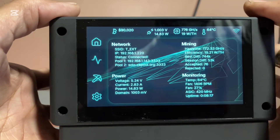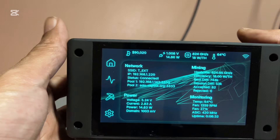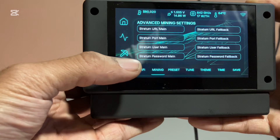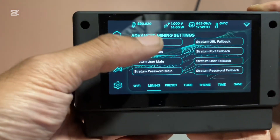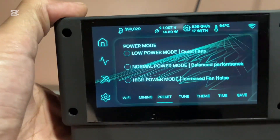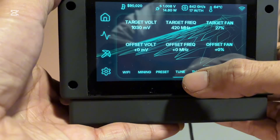Click a button and it'll show your hash rate. The next one tells you your network information and your IP address. After you type in your Wi-Fi and get it connected, I found it a lot easier to just type the IP into my computer and use AxeOS to set this up, because typing your bitcoin address and Wi-Fi on the touchscreen is very difficult. I tried to type in my pool settings on the screen and it was not working, so I had to set it up in AxeOS. I currently have it on low power mode so you can hear how silent it is.